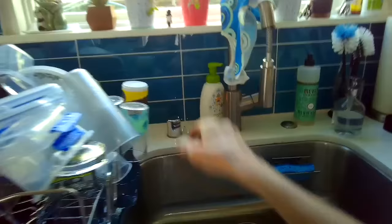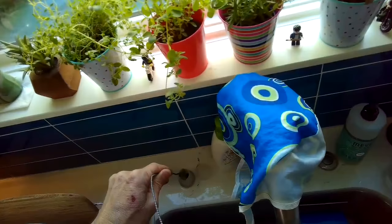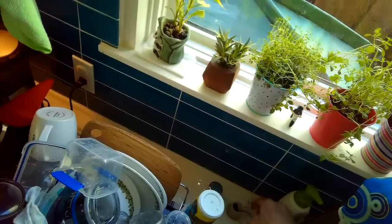That's an indication that the tube between the air gap and the garbage disposer is clogged. I removed the top and took a little snake tool and pushed it down into the air gap — not the center part, but the outer part.